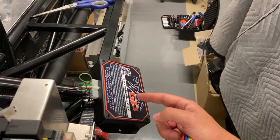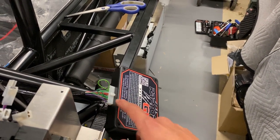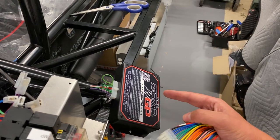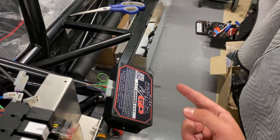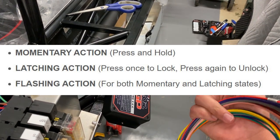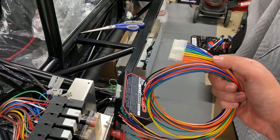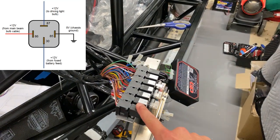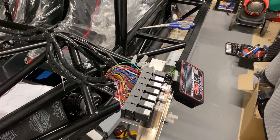This is the controls box for this one. The factory harness for the Ultima is already wired for this sort of stuff. In your own car, you just follow the wiring diagram — basically it's a series of wires that you use to either switch external relays if they're over 10 amps, or you can run up to 10 amps through most of these circuits to switch things as you please. You can have momentary, latching, flashing, or standard on-hold-off type function. Really good in that sense.